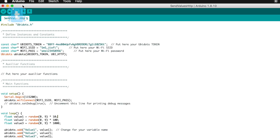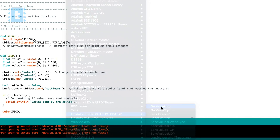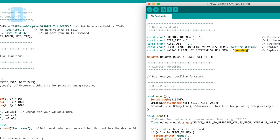There's also an example for receiving data from the server: 'Get Value HTTP'. We'll have a quick look - of course the three things needed are SSID, password, and token. As I said, the server has two levels: device name and variable name. You define the device name and the variable name from which you need to fetch data, and the data gets stored into a float value created inside the loop. That's the simplest thing I can ever expect from IoT server programming.